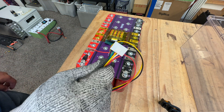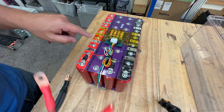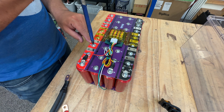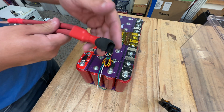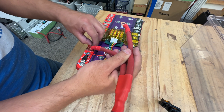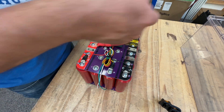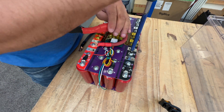Next, connect this connector right in here, then use some zip ties. Now we're going to install the main power cables. I'm going to skip one, two, and then on the third one — same thing on the other side. We're going to take these and loosen them. I just taped that end right here so I don't accidentally short it out, because this is a lot of current. Also, keep in mind that while you connect this, this one becomes live, so be very careful.